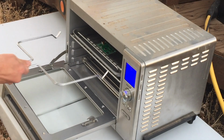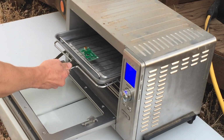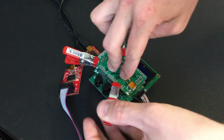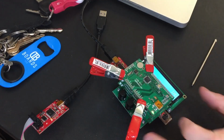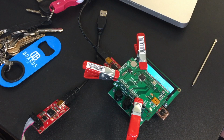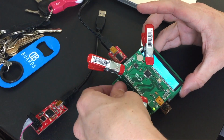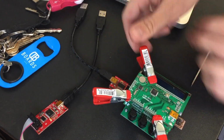Once the solder has set and cooled, we bring the board back inside to be tested and programmed. Small clamps are used to ensure the electrical connection of all pins are ideal. Then the SparkFun Tiny AVR programmer is used to burn the Arduino Uno bootloader to the onboard Atmega. The firmware is uploaded using the FTDI. Each board can then be adjusted to correct brightness, and the button and LCD header tested, along with uploaded firmware. Once the board is approved by quality control, it is sent to kitting.